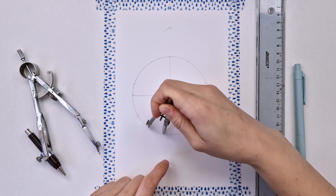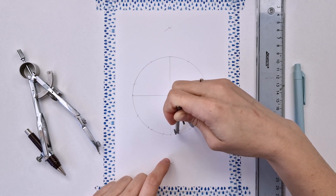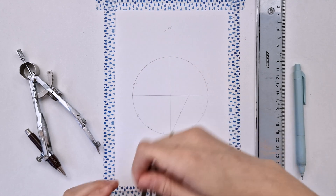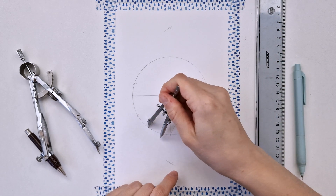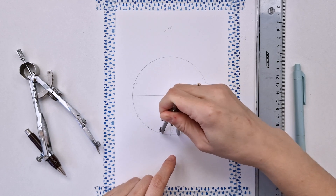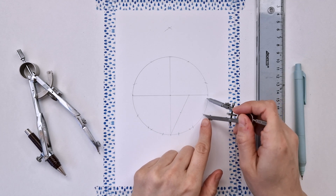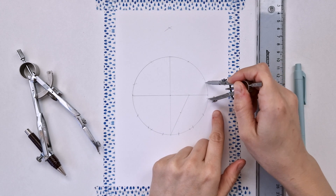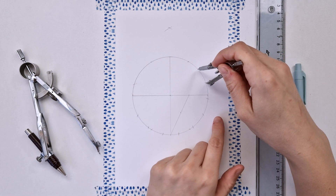Now what I'm doing is just using that radius to make more marks on the circumference. You can definitely delete the previous marks that you don't need so that you don't get confused. As you can see, I'm going back and forth a couple of times just to make sure I have the perfect division here, because one-fifteenth is a really tricky one and even the slightest mistake can bring a non-matching of the division.